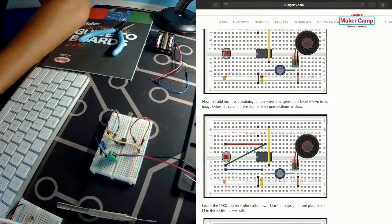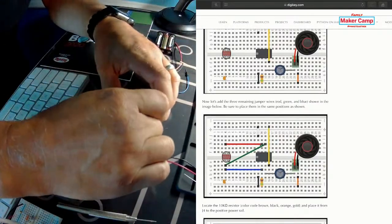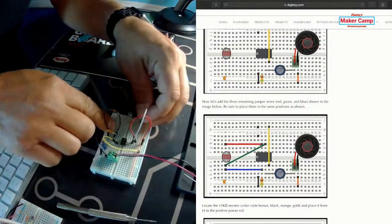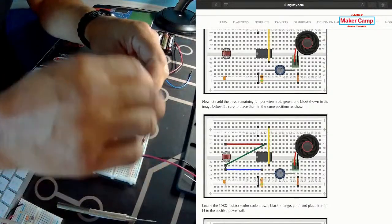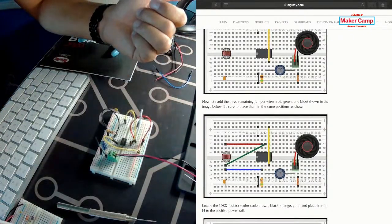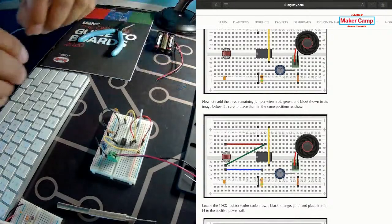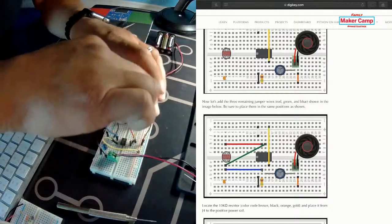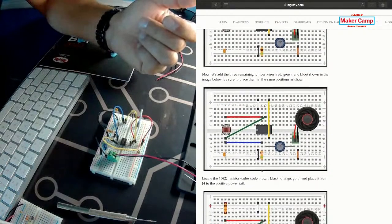Now let's get this light sensor electrically connected. In 4H we're going to connect over to the 555 timer — bring that over to 14H, and 4H to 14H. Then we have 15H jumping to the other side of 4D. And then 4C connects to 14C. There we go! I do love how breadboards look like a spaghetti factory — a big spaghetti mess — because it just shows progress in my mind. We're getting pretty close to finishing this simple breadboarding circuit.